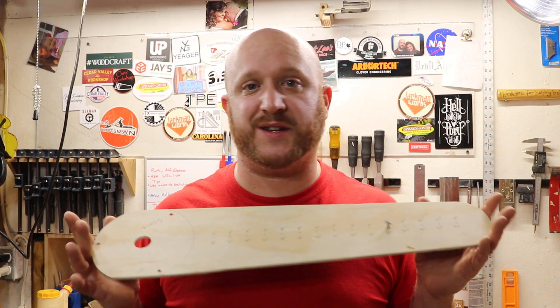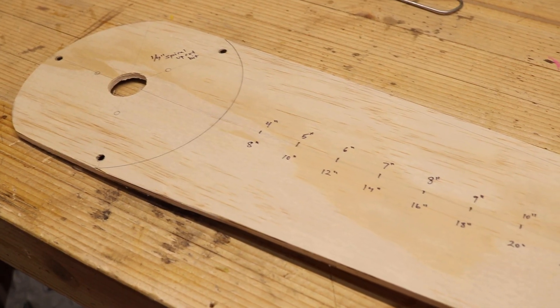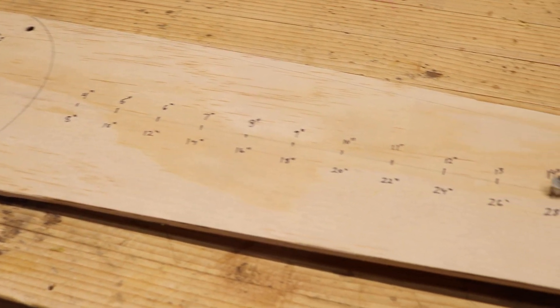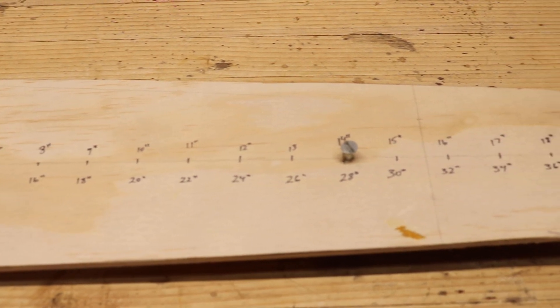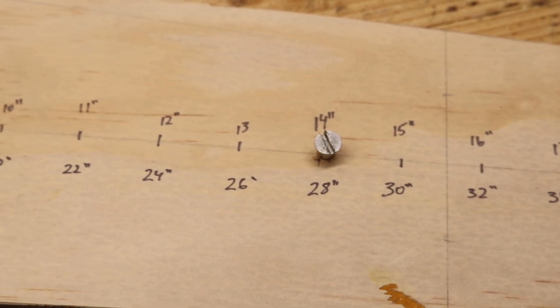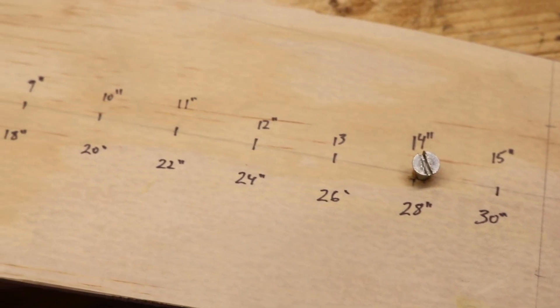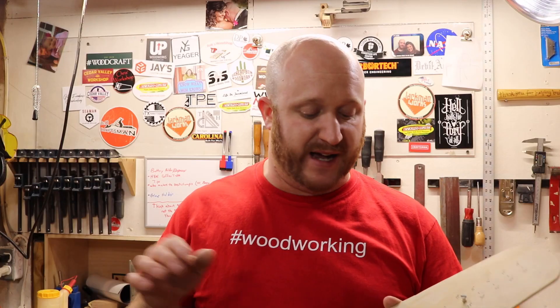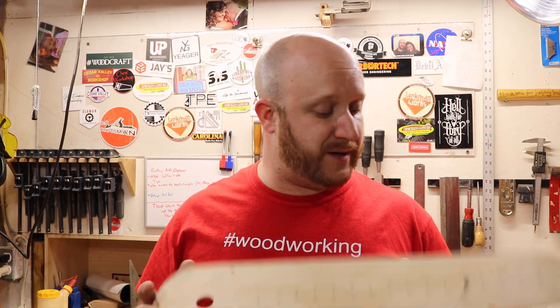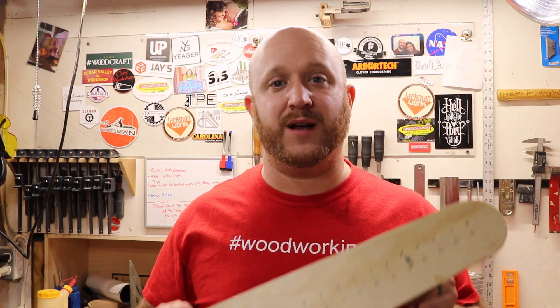Okay, so it's all done now. What I did is I took that board and trimmed it down a little bit, did some nice sanding on it, and took the screw. I marked off every space with a ruler — the top number is the distance from the router bit to the screw hole, and the bottom number is the size the circle is actually going to be once it's cut. Something like this I can use many times over. I didn't drill all the holes yet because I may never use some of them, and if I have all those holes it might get a little weak over time — so as I need one I'll make a new hole. Just be sure to use a screw that's the same diameter as the hole, because if there's any wiggle room you're going to end up with a wonky circle.